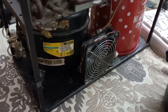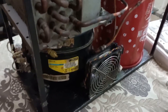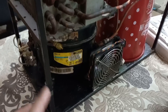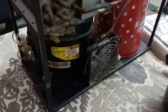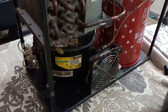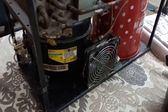I didn't have used oil, so I added 250 ml of new oil into this compressor, then moved it left, right, up, and down so that the oil moved everywhere inside the compressor, then ran it for 5 minutes. After that I took out that oil and threw it. I left it for 15 or 20 minutes in sunshine to 100% confirm there would be no chance of water inside this compressor. Then I filled 325 ml of new oil.